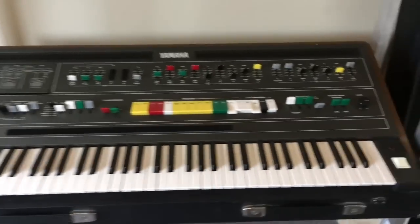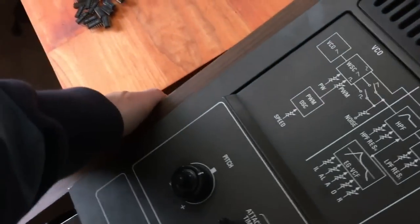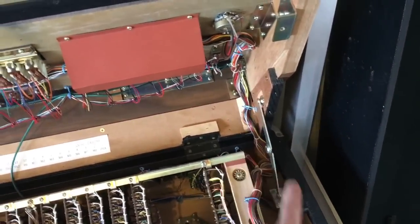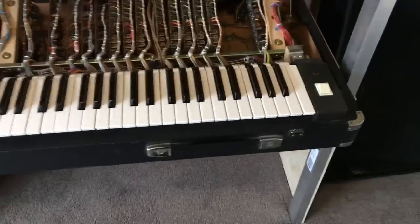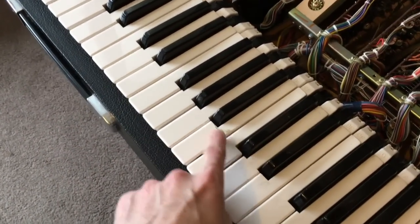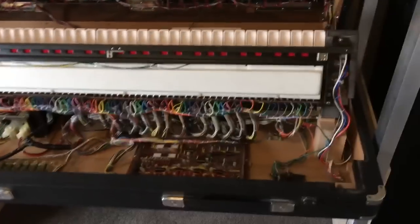But once they're done it's not too difficult - the panel will lift up. I may need two hands to do it though because it's quite difficult with one hand, there's no way to grip the keyboard. The easiest place is under the keys, but if you use only one key there's a chance you can break it. You can see someone's already broken this key. So full hand underneath and then lift up.